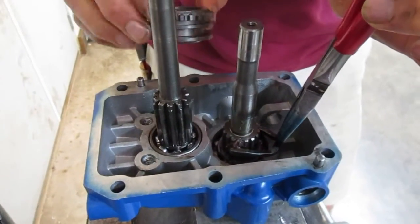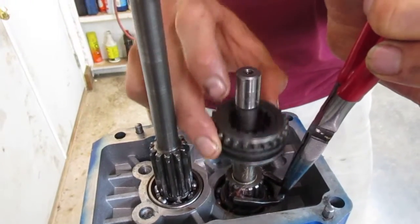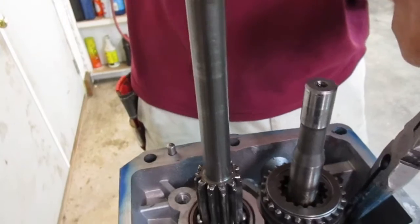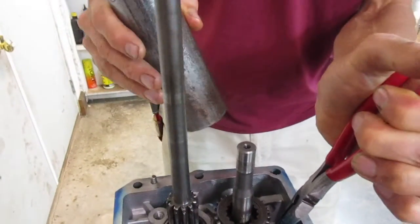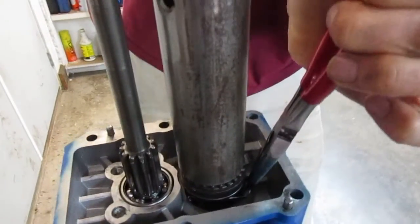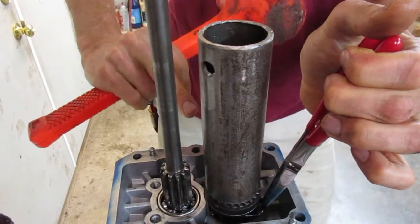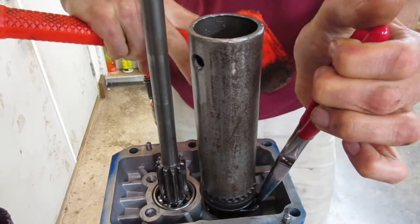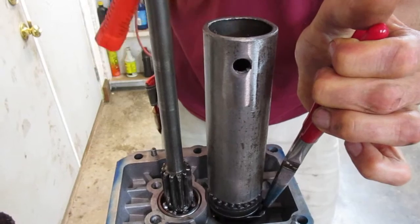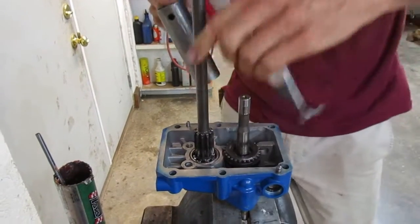I'm going to take this collar — it can go right side up or upside down, but I want the gear teeth up because that's the side that interfaces with the big gear. I'll set that down on there, then set this piece of pipe on top, grab a dead blow hammer, and give it one good smack. That drives the collar down, the collar shoves the pliers off of those balls, and if I hit it with enough force the collar will trap the balls in place. Squeezing it good and tight — give it a good pop. Voila, we are done.